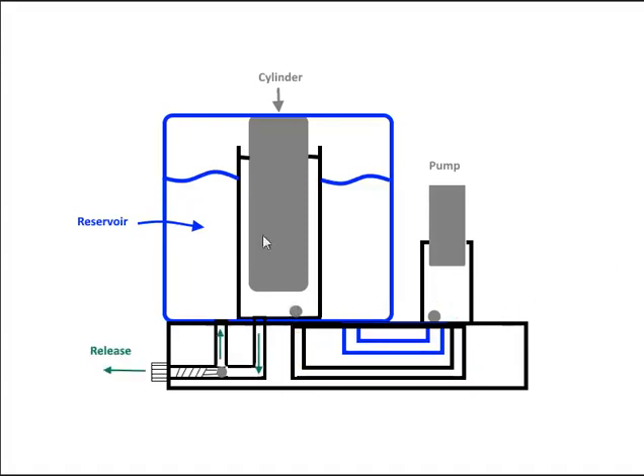When we want to release pressure, we unscrew the release valve and a little ball bearing allows the higher-pressured fluid to come through and go back into the reservoir. This is at the bottom of the reservoir — there's no need for a valve here, we have a mechanical valve. The default position of these check valves is closed, and gravity holds them in position. There are no springs — it's just a little cavity with a retainer on top, and gravity holds these valves down.